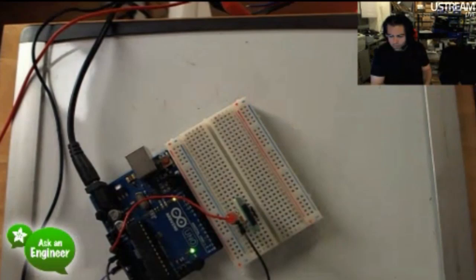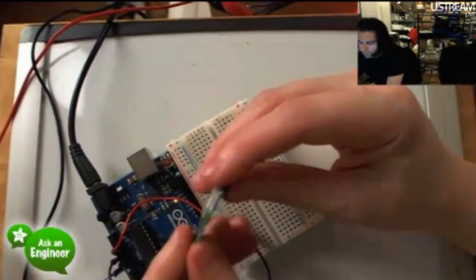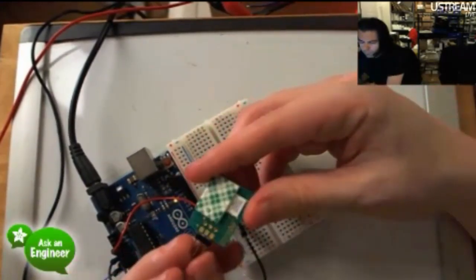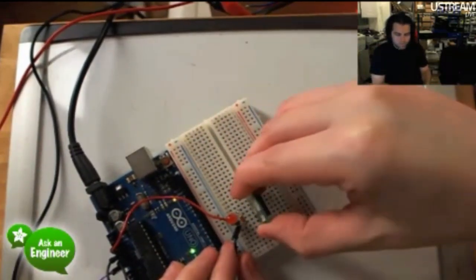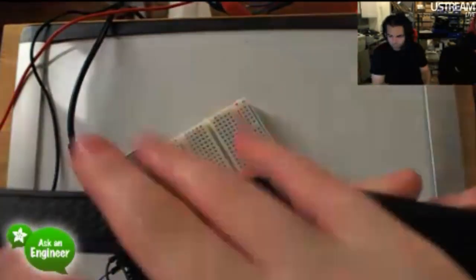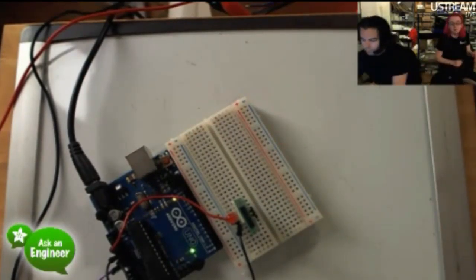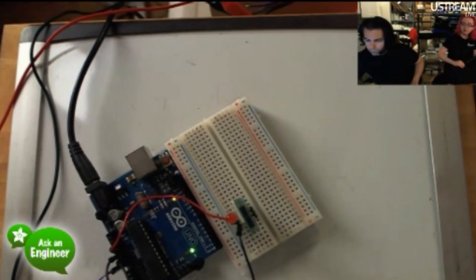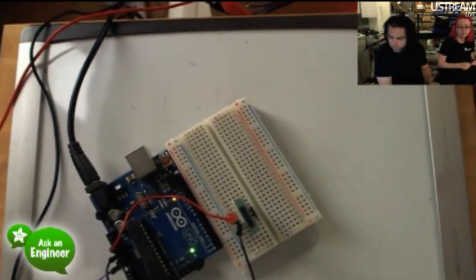The receiver has a little antenna and then the special chip from Polar. It's really easy — it basically runs off three to five volts. You have a three-pin connector. I just have it connected to an LED. Here's the strap — you can see there are these little pads, and in the center that's where the circuitry and the transmitter goes. It only works about three to four feet away, because it's meant to be used in gyms where multiple people in the same area all have the same kinds of straps, so it doesn't want them to intersect.